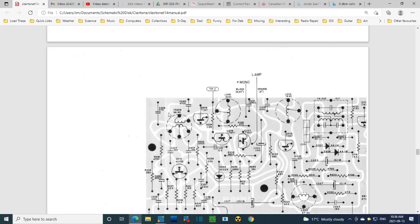So I've located this and I've proven it out. What I did was I saw that there's a trace here, and this is the second trace in from the edge of the board. Now there's four terminals in this trace, and so I have found it for sure. And there's no test point created here. So I'm going to solder a little clip lead hanging out from the back here to connect the meter to.